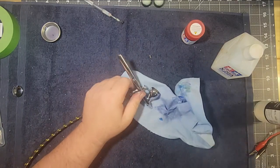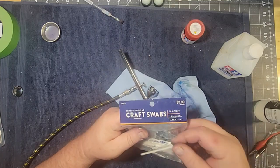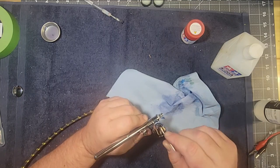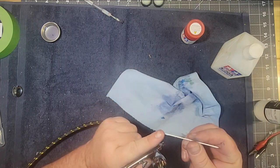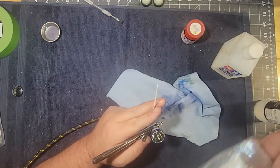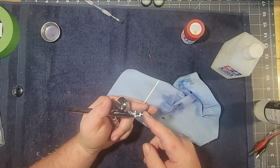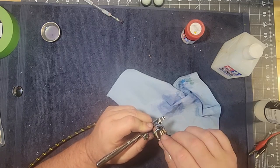I'm wiping this out. You can also use these little cotton swabs — or cotton buds as they're called in Australia and the UK. I don't recommend swishing these around getting them wet because there are little fibers that can come off. I'm using a really good solid brand — I wouldn't use a normal Q-tip with all the little fibers sticking out, because if one falls off and gets in there, the nozzle on these things is so small that just that little fiber could be enough to cause a clog and make it a very bad day.